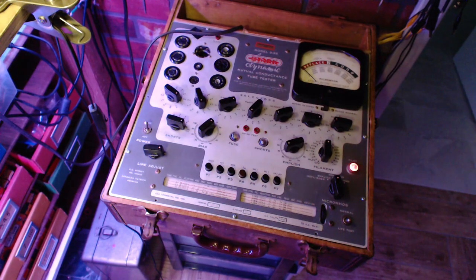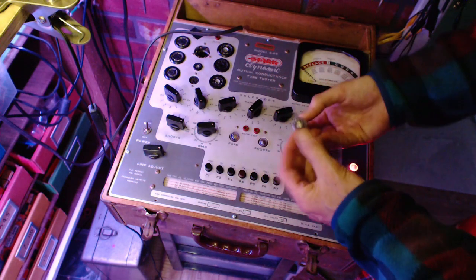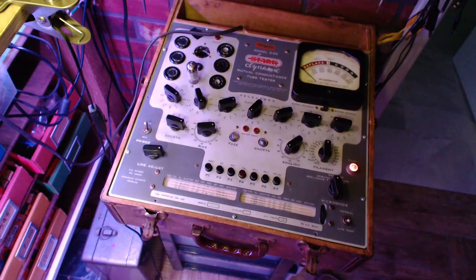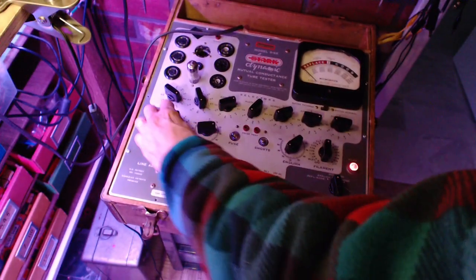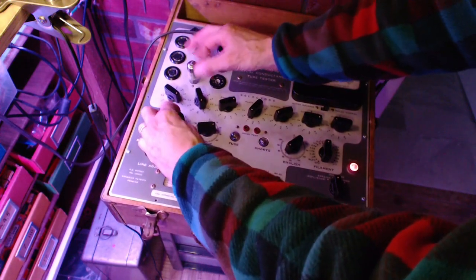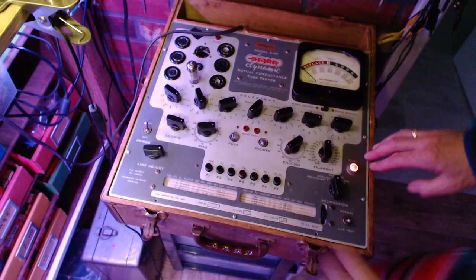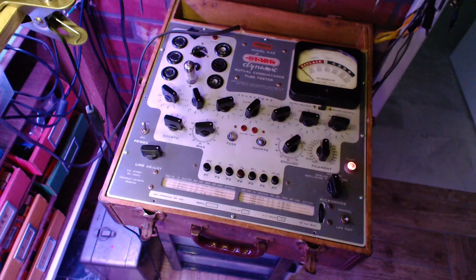EF89. Okay, now I'll get everything set up and we'll do the EF89. Okay, definitely EF89. Double check the settings already. And you go. Shorts. Now a lot of tube testing manuals will tell you when you're doing the short test you should be tapping the tube. They don't do that. There we are. So an EF89, I have to check here quickly, 1320.